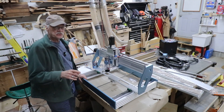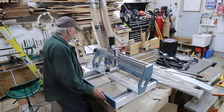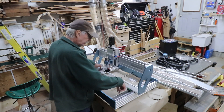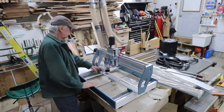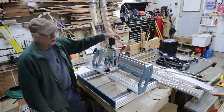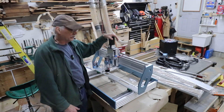First impressions - this thing is beefy as all get out. It's built like a tank. All of these parts are half inch aluminum. The bearing guides for the traverse X, Y, and Z are extremely robust, heavy units. These are NEMA 23 motors - very robust. These will go 3,000 millimeters per minute, and I'm never ever going to do that. That would be just dangerous.